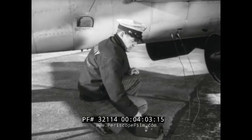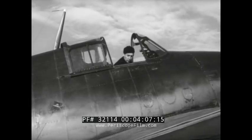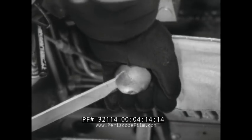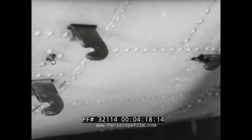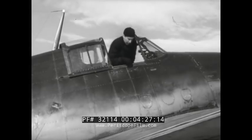From 6 to 24 volts are required to fire the jet units. Always leave the switch off. Finally, check the release mechanism to be sure that the units will drop freely. Each hook will take the full 1,000-pound thrust of the unit. This completes the check-up of the firing and releasing gear.